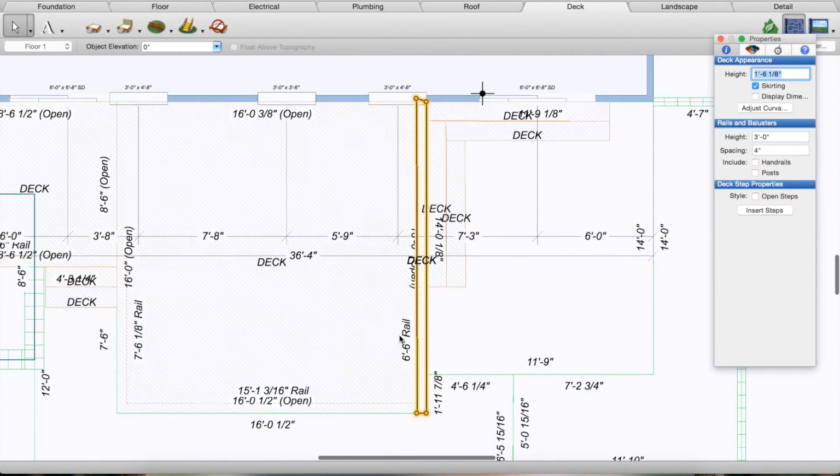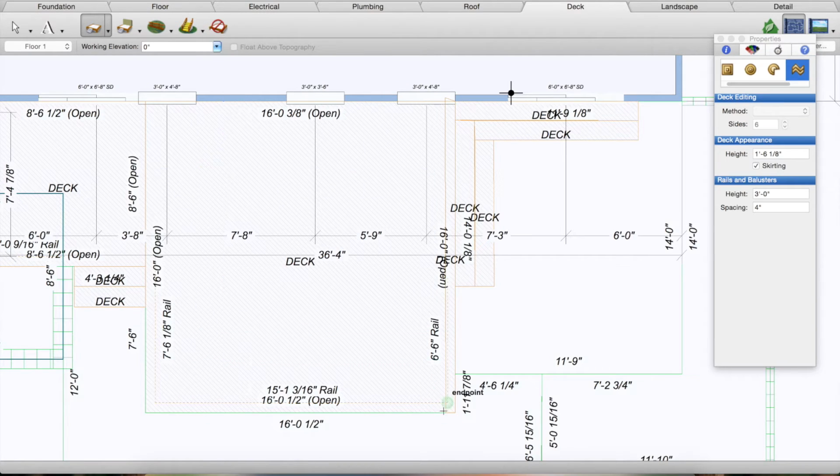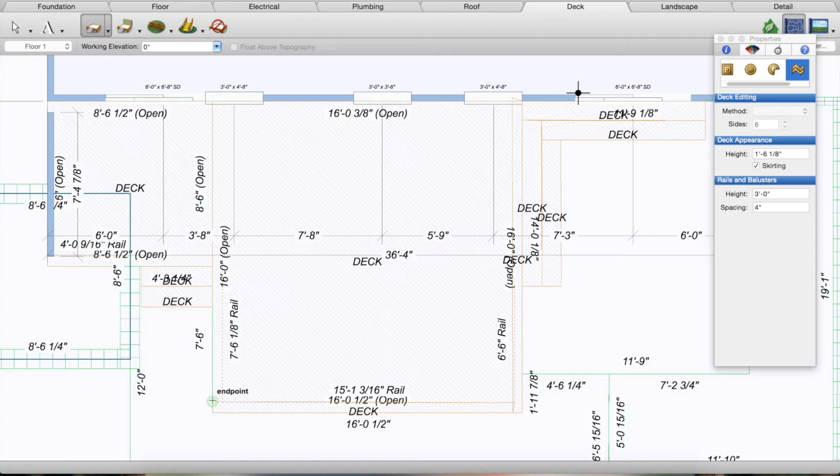And it's basically going to be 1/8 of an inch above our deck. You won't be able to tell the difference, but it's going to mean that whatever color we choose for that is going to show over our field boards. So we're making these about 6 inches wide, like a normal deck board. I'm just going to go around and draw this border all the way around.